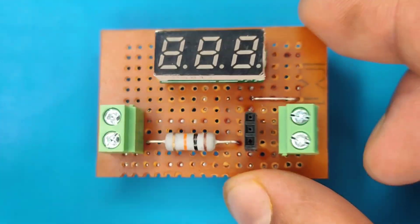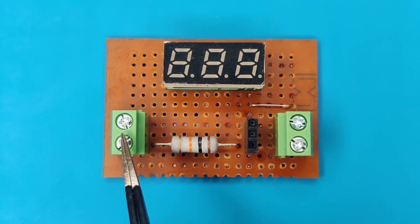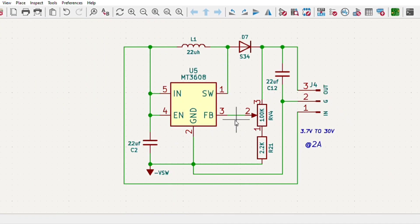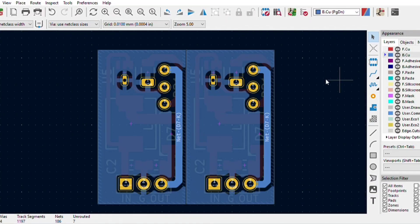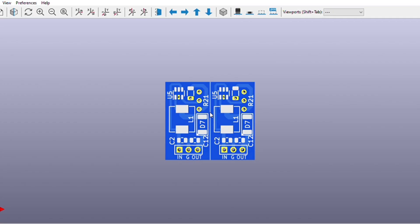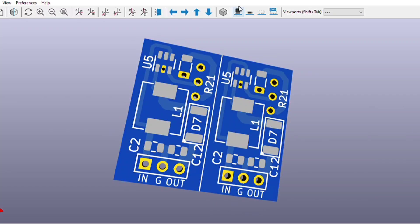Now the soldering is done, and our circuit is almost ready. But here we need a voltage booster, which will convert 3.7 volts to 30 volts output. For easy assembly, I designed a simple circuit diagram which uses the MT3608 with a few other components, and converts 3.7 volts to 30 volts with about 2 amperes. Then I converted the schematics into the PCB layout, and the PCB is going to look like this. You can download both the circuit diagram and PCB files — the link is in the video description.